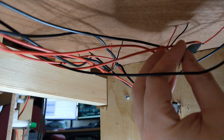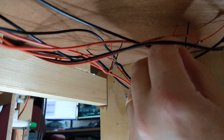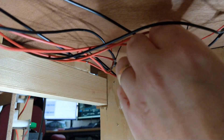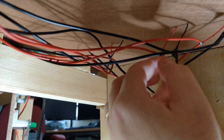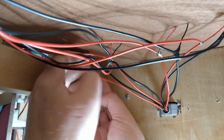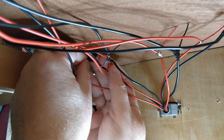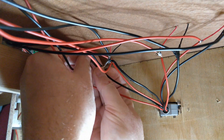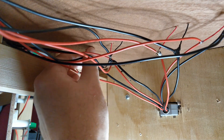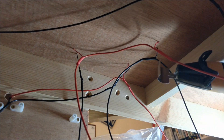My use of electrical tape to insulate soldered joints has been debated in the comments previously, with the suggestion made that I should be using heat shrink instead. Heat shrink does have a few restrictions that need to be accommodated. It requires pre-planning — you have to thread the heat shrink tubing onto the wire before making the joint, otherwise you'll be unable to install it. This means retrofitting the existing section of the layout is not possible. It also does not support a T-shaped joint; you must lay the wires parallel away from the solder joint. It's also one of those things, like crimping, that you have endless trouble with if you don't have the proper tools. Just like trying to make a successful crimp connection with a pair of pliers is very hit and miss, if you're trying to install heat shrink by waving a soldering iron near it, it's going to give inconsistent to poor results. With the right tools however, like this new heat gun and curved reflector that I've treated myself to, it works much more consistently.